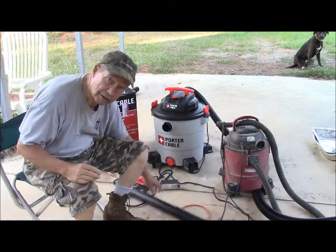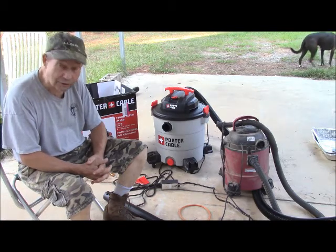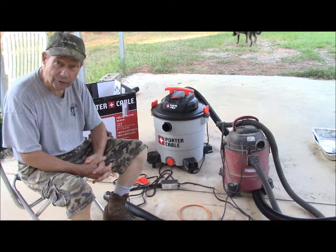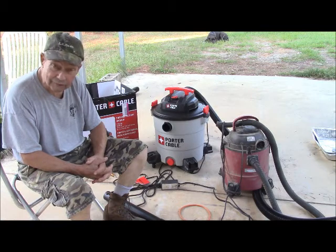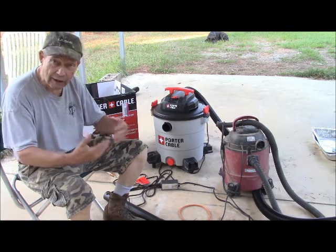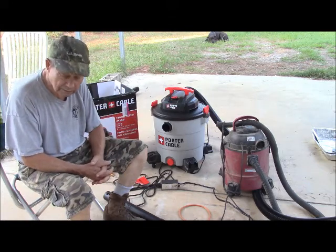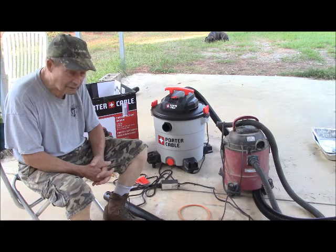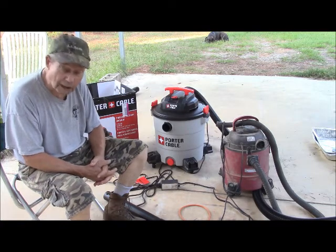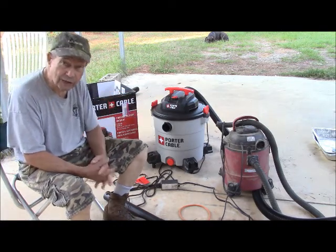I have a two-inch opening on the air duct of my forge. With a little modification that I'll show you in a minute, I can adapt the hoses to fit my forge. One thing that is detrimental about going through from shop vac to shop vac is that they have different air outputs. The little fellow here from Harbor Freight is comparatively weak — it will pick up, but not tremendously well. The larger one that I started with originally was more powerful, and this one is much more powerful yet, as you might expect from the size of the accessories and hoses.